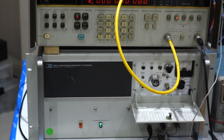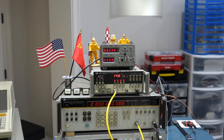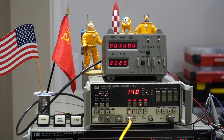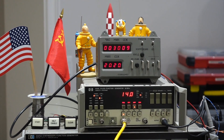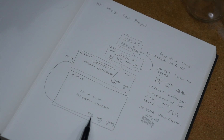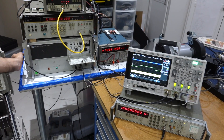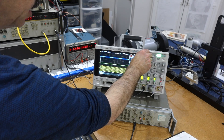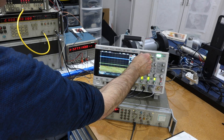So here is my Cesium clock. On top of it is the HP-3325 frequency synthesizer, then is my 800 Hz modulator, and on top of it there seems to be a whole scene — celebrating American and Soviet engineering, with a little touch of freshness: Tintin has arrived and landed there, really wondering what's happening. At the bottom is our HP-5061, the Cesium clock, which is actually a frequency standard. We have our 5 MHz coming out here and going to the back of this instrument, and also a 1 MHz coming through. That's our atomic clock reference — our super precise oscillation. It would be off by one second every 3,200 years, so that's pretty stable.